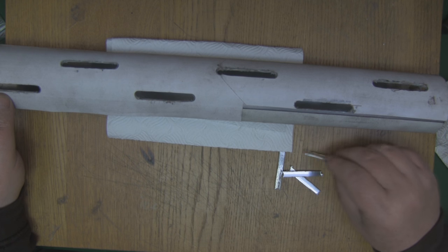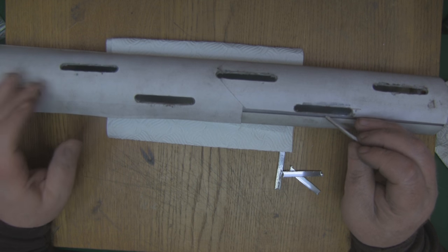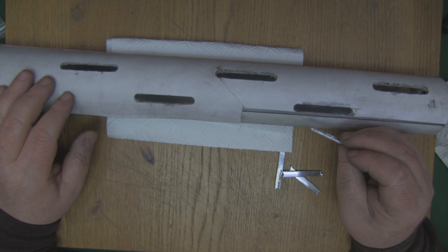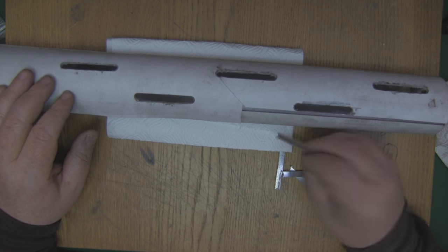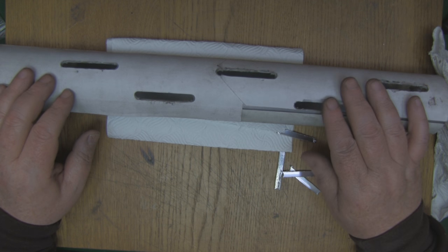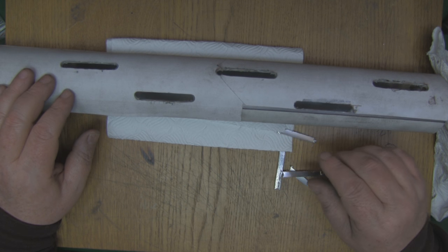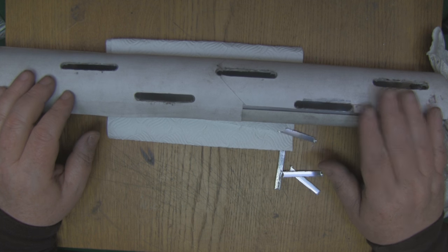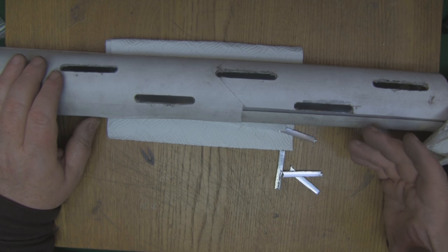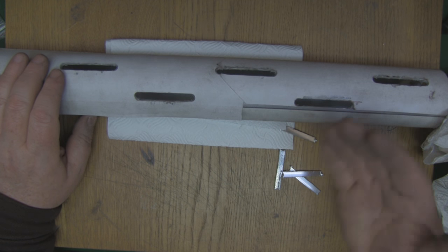One side is cut out and it's going well, but it's taken the best part of half an hour. If I were choosing materials again I'd try to find tubing that's one millimeter or slightly less thick — it would make it a lot easier. This is really dirty work; I've gone through about 10 cutting wheels just for this one side. Bear that in mind with this material, and use a face mask to keep the dust out of your lungs.